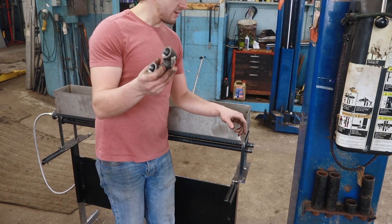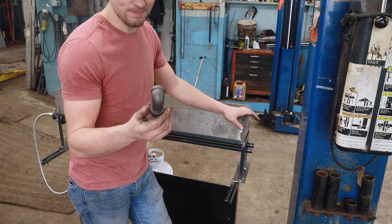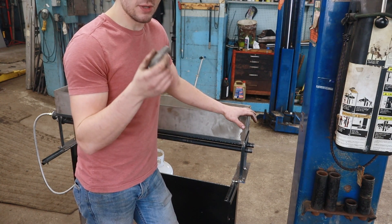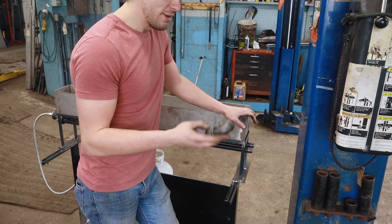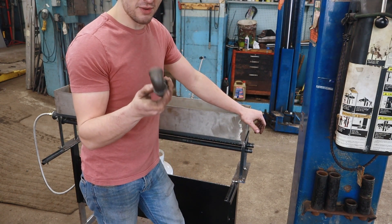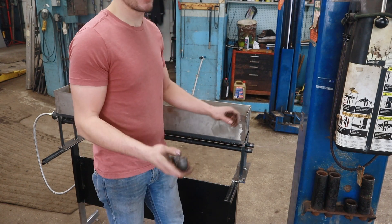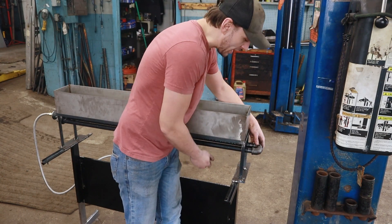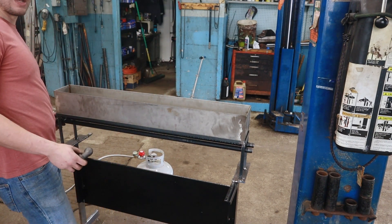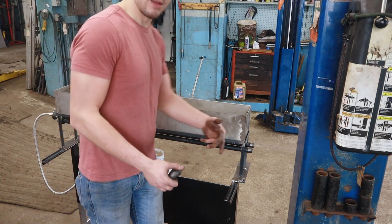Got my street 90 and my standard 90, and they're gonna go right here on the end. Let me tell you something - don't use a street 90. Pipe threads are tapered, so when you're trying to fit a predetermined size and you need those threads to go in a little further, it's just not fun. I'm gonna get this pipe loosened up here and thread it with the 90 at the same time. It's gonna be a little goofy, but it'll be fine - might be a little funny to watch.